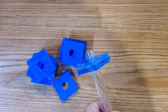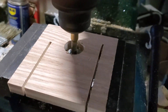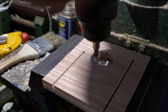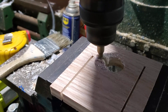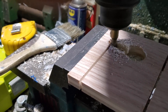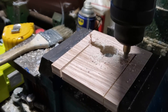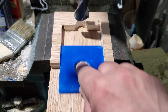The other thing I could have done is taken a thinner sheet of acrylic, a long strip, heat it up, and then while it's still malleable, twist it — that would also form the helical pattern for the screw. But the reason I'm going this route is I had a little extra time, and I came across a woodworker who took a bunch of discs of different types of metal, glued them together in a helical pattern, and turned it down to a rod. At one point it looked exactly like the drill bit you see right there, and I thought this would be an interesting way of going about this.